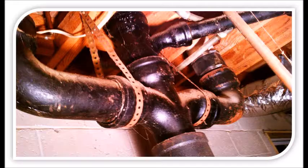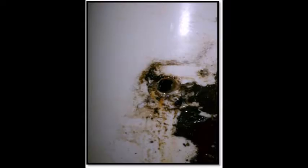This old cast iron plumbing system from the 60s can give a lot of trouble and can be replaced with PVC pipe and brought up to code. The hole you see here was made when the owner installed shelves in their closet. It was a three-inch discharge line for the toilet and the rest of the plumbing on the upstairs bath. Being closed up in the wall, it went unnoticed for a good while. When the owners could not get rid of the dampness and mold smell, they called us out. We located this pipe in the wall, removed the sheetrock, and found the hole.